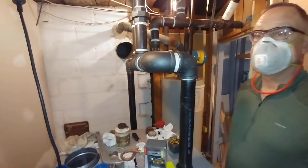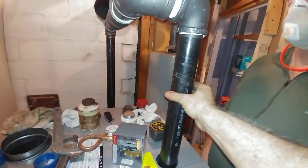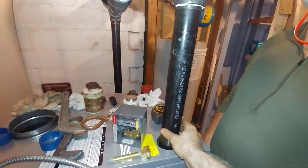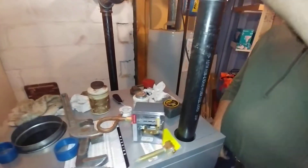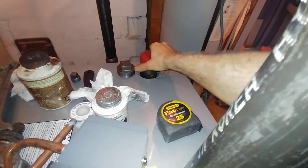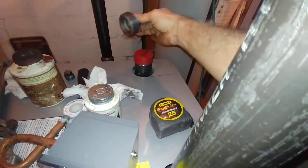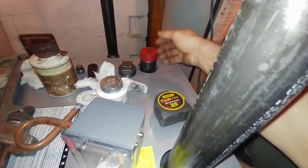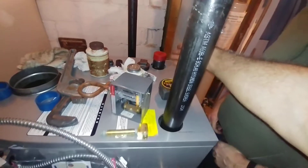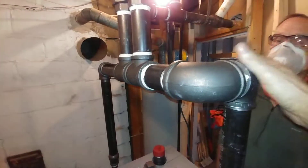Here is our piping — we've got a two-inch outlet. I wouldn't mind a two-and-a-half inch if I wanted the moon. In this size, the five-section, they say you only need one outlet and you plug the other one. What we're going to do is run a nipple and put a cap on here, so we don't have to take anything apart to add water or check stuff quickly. Then we go to a two-and-a-half inch size here.